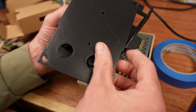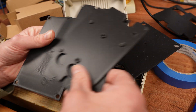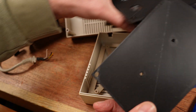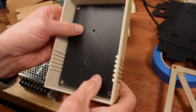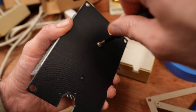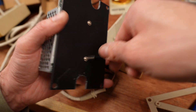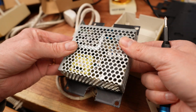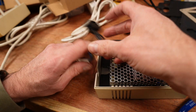So I ended up designing my own. These work great and I wish I'd had more time to record that process, but these parts here are what was left over. This one looks to have all the holes in the right places and it fits perfectly. The mounting holes for fixing the Mean Well also line up just right, so I'm going to use this rather than printing a whole new one. Screws suitable for a floppy disk drive are the exact right type for this and as long as they're not too long they'll do a good job of holding things in place. I've also cut out a couple of sections at either end of the caddy for the mains wires — I don't like running them over the top of the metal case, as that feels like asking for trouble with single insulated mains voltage wires.